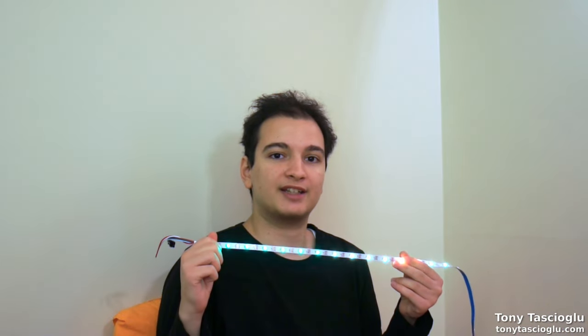Some background: why might you want to use WS-2812 LEDs? WS-2812 LED strips support controlling and addressing each LED pixel individually. They can be daisy-chained, and you can address each LED in sequence one by one and give it an RGB color. As opposed to traditional RGB LED strips where you provide a common anode or cathode plus R, G, and B to the whole strip, these LEDs only need three pins: 5 volts, ground, and data in — plus data out for daisy-chaining. You only need to connect three pins of the first LED to your Arduino. The fact that each LED can take in data means we can send a different color value through daisy-chaining, controlling the color and brightness of each LED individually.